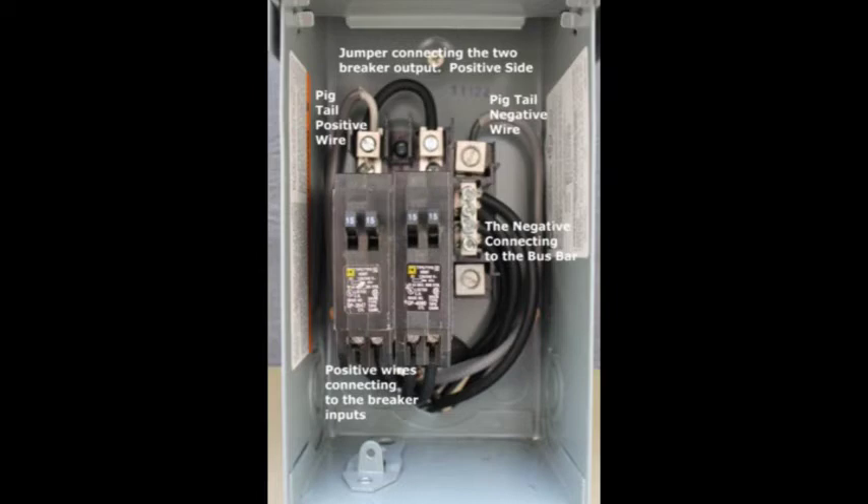At the very bottom you can see the four wires coming from each panel to their respective breakers. One of the biggest benefits of having a breaker on each panel is the ability to isolate panels for troubleshooting. You can turn all of them off except for one, check your charge controller output, and do that one at a time for each panel to make sure each one is operating as expected.